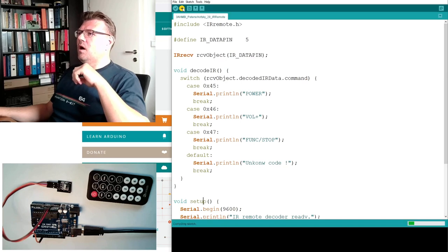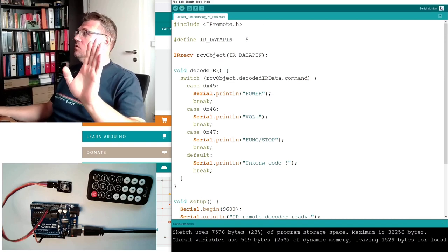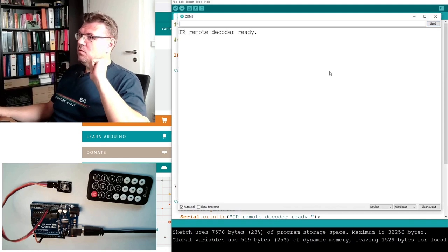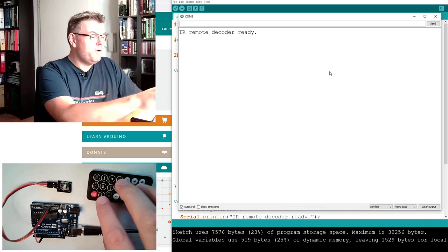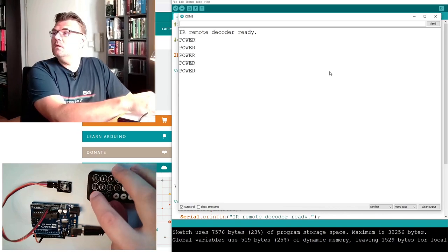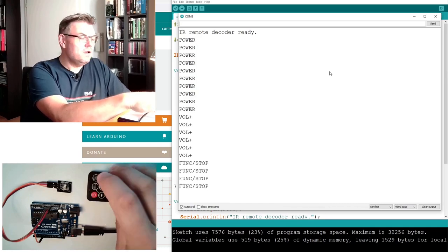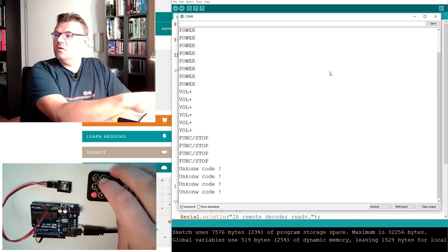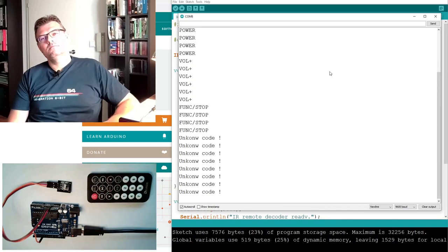I will try to upload this now. It is compiling, this is already nice. So we will open the serial monitor and see what we see. IR remote decoder ready. I'm pressing now the power button: power. Oh, volume plus, func, func, any other button: unknown code, unknown code, unknown code. You see,